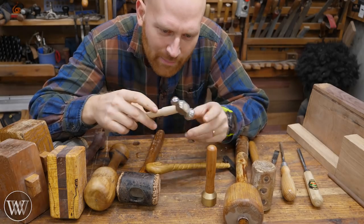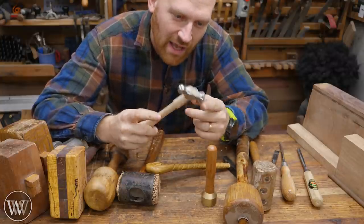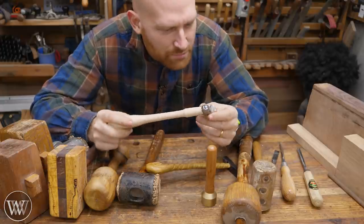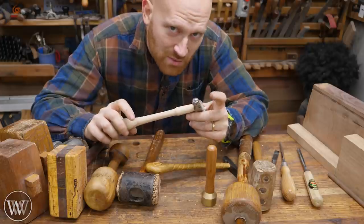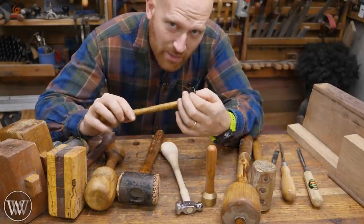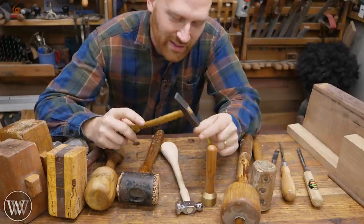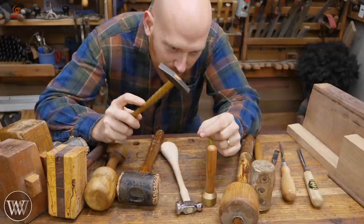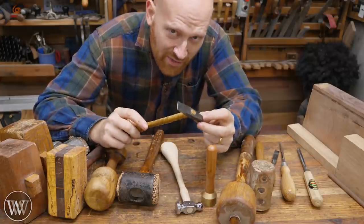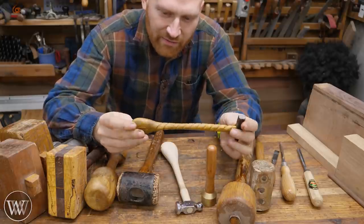I have two other little ones here. This one is commonly referred to as a chasing hammer. You hold it back here on the pommel — this is for chasing work, which is basically carving in metal. Having a large flat face you can tap easily, and the ball-peen allows you to do some roundover and riveting. I don't use it as much for woodworking, but anytime I want to do some light peening work this one comes in very useful. I also have a plane adjustment hammer — it's got a wedge on the back so you can eject wedges out of the plane. It's a very lightweight head, only about three ounces, incredibly light. Anytime I want a very controlled impact and to move something a very small amount, such as plane adjustment, this comes in very useful. A lot of plane adjustment mallets have either a leather head or a brass head so they're not harming the metal on the steel iron.